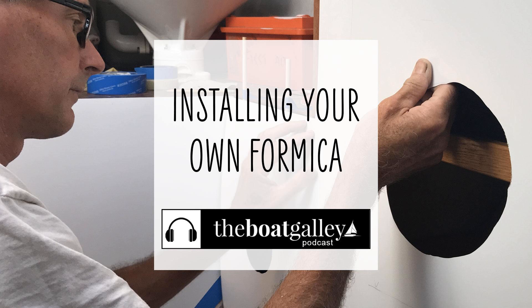You'll rough up the surfaces with sandpaper and acetone-clean them — and when I say both surfaces, I mean both the bulkhead and the backside of the Formica you're applying. You apply contact cement to both surfaces. As a reminder, contact cement stinks — it's terrible and very toxic — so make sure you wear a respirator. We're using a cheap chip brush and pick off any bristles as you go. Apply a second coat of contact cement to both surfaces and let that dry 15 minutes.